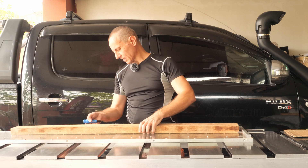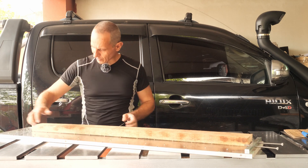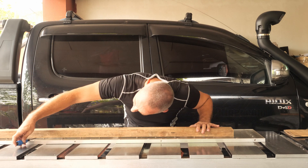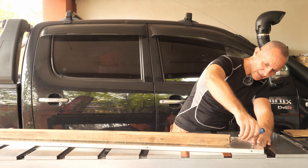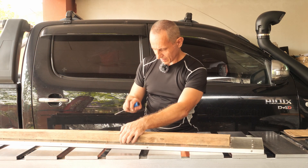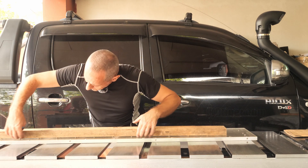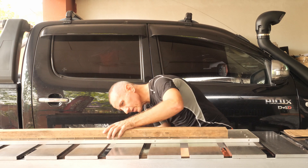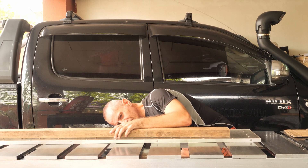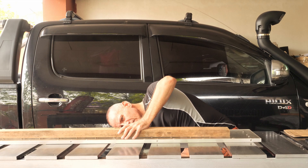The gap and the cup is on my side. I'll rotate it so you can see better how I adjust it and how the allen screwdriver can go under the material. This part is touching the sled and now the other side is also touching the sled — that means the board is twisted, cupped in the middle and twisted. So we will start from the highest point, find the allen grab screw, and protrude it. I'm not going to put excessive force, I just want to touch it.